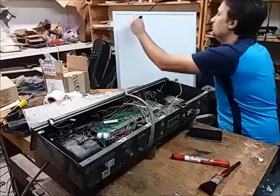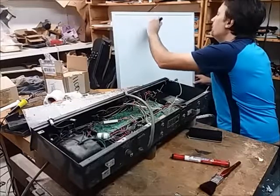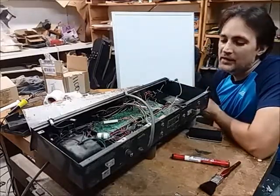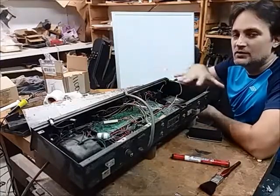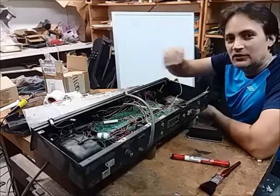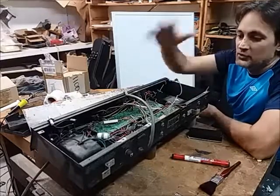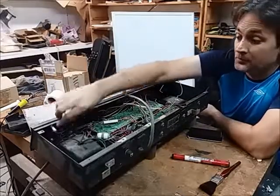All these years later, I've come across this next V4, and that is the version with reverb. There are some other preamp differences, but I'm not going to get into that much. These amps were really built identically between the two models — guitar and bass — and there are just some parts inside that, whether they are excluded or included on a circuit board, makes the difference between an Ampeg V4 and a V4B. The circuit boards are the same, the transformers are the same, and the controls in front are largely the same, but not identical.